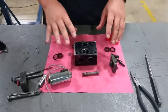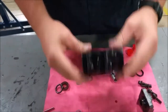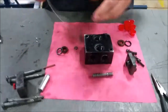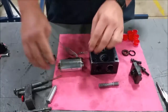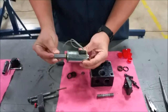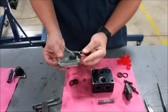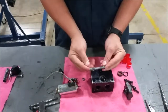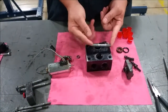This valve is just a solid cast piece of aluminum. This other valve is solenoid operated, which means electrically operated. You have an electric charge, it charges the coil and allows the shuttle to move into the valve and push this copper rod out. What that copper rod does is it actually engages the valve inside to on or off — it's a push solenoid, so it actually engages the valve.